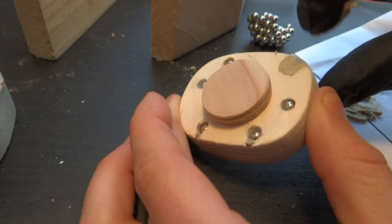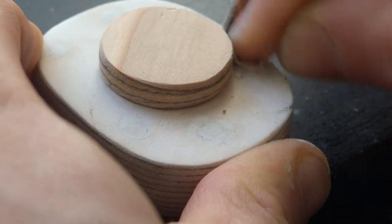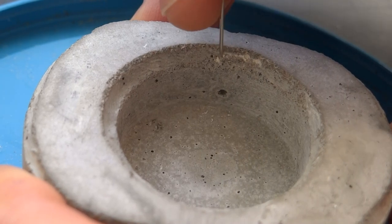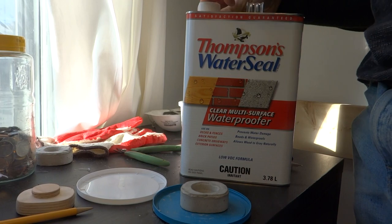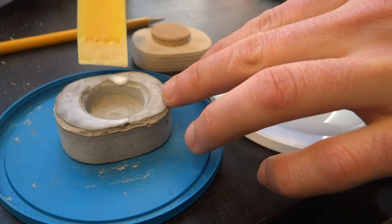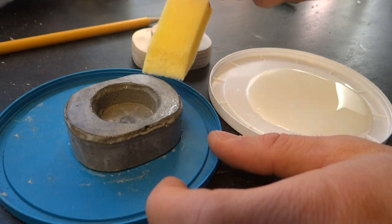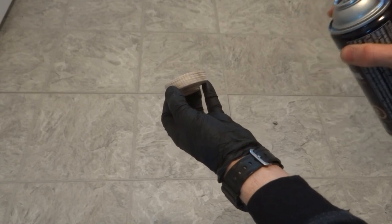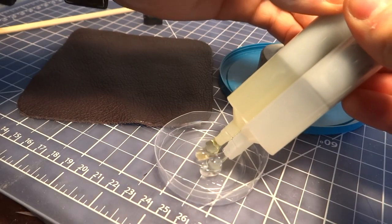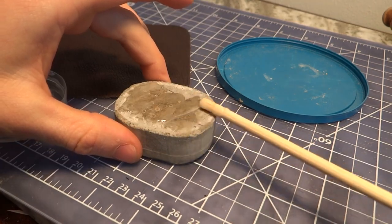I filled over the magnets with wood filler and then sanded the surface flush. Before sealing the box, there was still some little bits of plumber's putty stuck on the concrete, so I just scraped this off with a needle. I sealed the box with Thompson's water seal, which I am desperately trying to get rid of — maybe a good excuse for an outdoor furniture project. While this was drying, I finished the top with some spray-on satin polyurethane. The final step was adding a pad to the bottom of the box using a piece of scrap leather. This makes the box sit nice and flat on a table without scratching its surface.